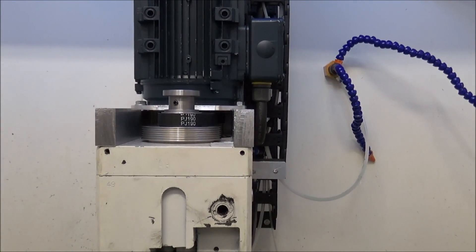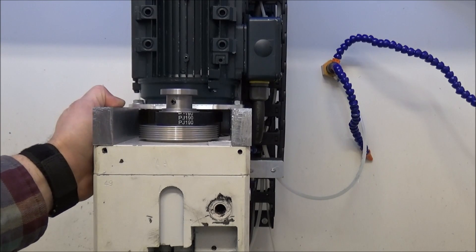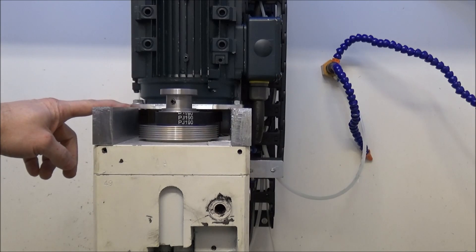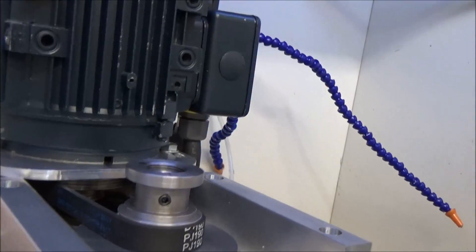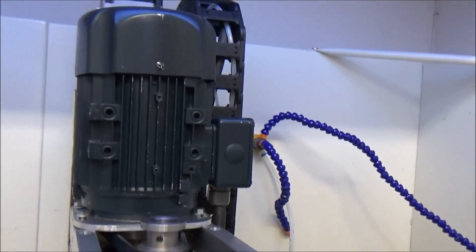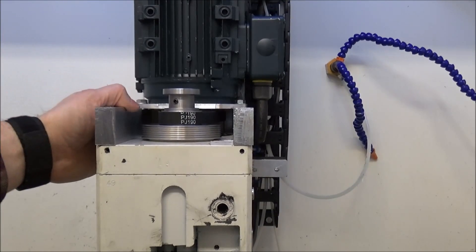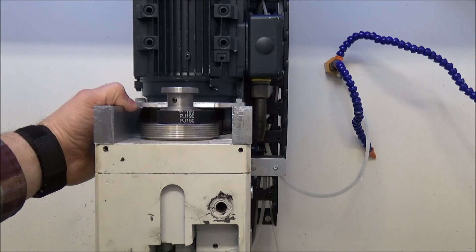Looks like the belt drive turned out okay. I'm pretty happy overall with the way it turned out. My pulley height was just a hair off, so I had to raise up my motor plate here — I'm going to have to adjust my drawings to account for this. I think I did pretty good considering it was about 40 thousandths that it needed to come up a little bit more. Later on I'm going to be putting a different motor on here, so I'll be making a whole other mounting plate and I'll just make the adjustment there.